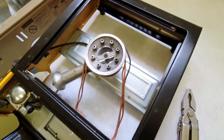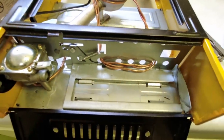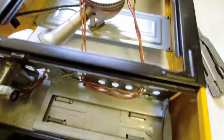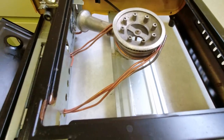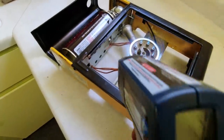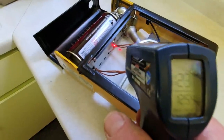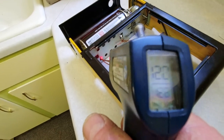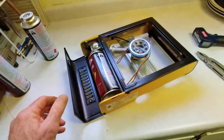Now the wire will bend really super easy — it's just nice and soft. What I did is I took the wire and I just wrapped it around that burner and down through the opening down here to where it left this wire exposed. I just want to see if this works. The temperature of the wire right down there is 120 degrees — 119, 120, 123 — both sides. So that's got to be transferring heat to the bottle. I'd have to say yeah, it's probably working.